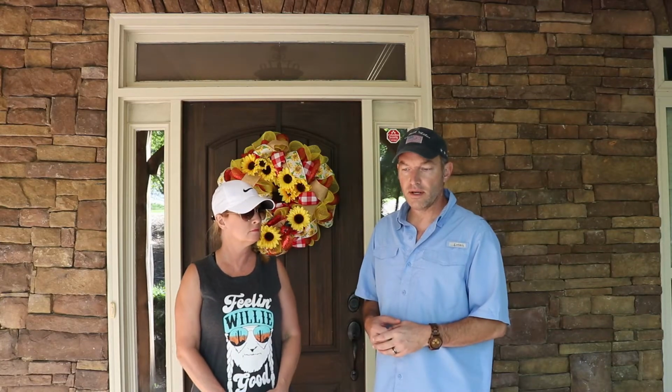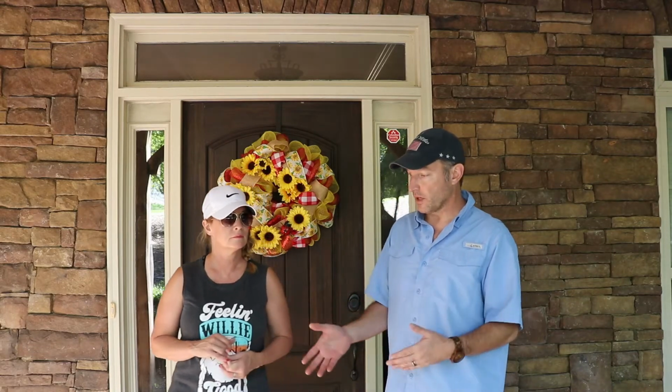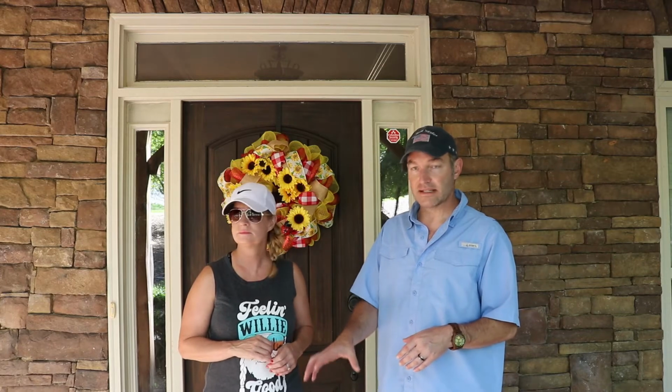Yeah, what do you think? We could have. It's an easy enough project to do in 1 day, if you start early. If you start early on day 1, I think the longest wait time is just waiting for stuff to dry. Whether it's waiting for the concrete to dry after you wash it, or waiting for this acid stain to set up for its 4 hours, it all depends on which manufacturer you go with how long the wait time is. But we're pretty pleased.